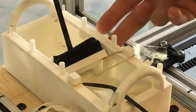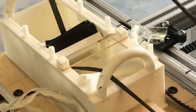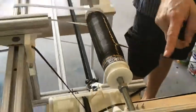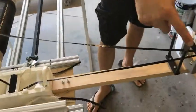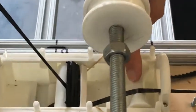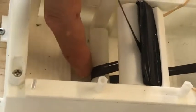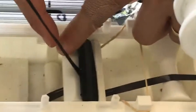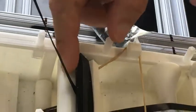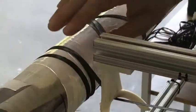On this train here we have what we call the epoxy resin bath. When we go to create a tube, we mix up some epoxy and put it into the bath. When the carbon fiber machine is running, the carbon fiber comes down from the carbon fiber spool right down to the back roller. There are guides to make sure the carbon fiber doesn't run off the roller. It comes over this roller, then goes under this roller right at the front so the epoxy can get right into the carbon fiber. Then it comes up between this pulley and what we call a doctor blade, which helps to remove excess epoxy. Then the carbon fiber goes over this roller and under this device, which helps to get the carbon fiber onto the mandrel where we want it.